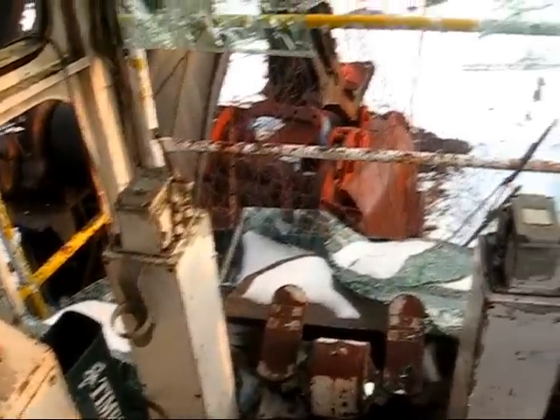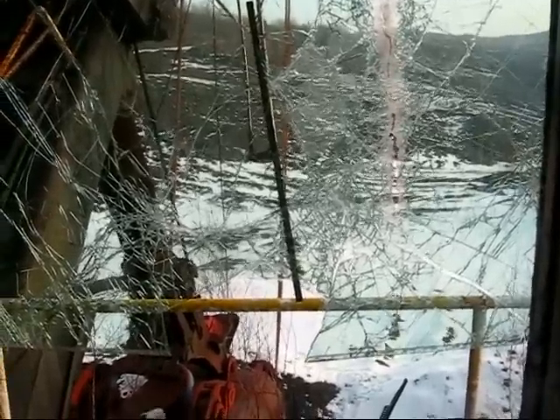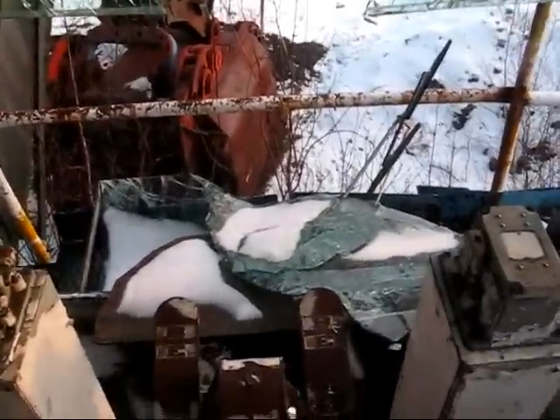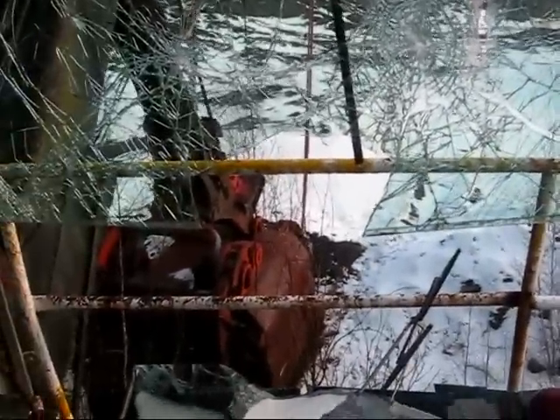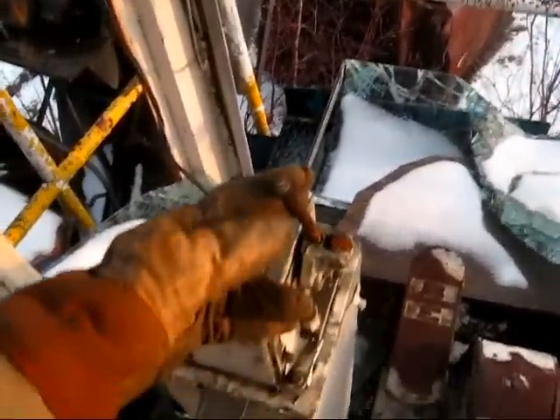Here's what's left of the operator's cab on the 195B. As you can see, this machine has been vandalized — the windows have been smashed, the seat's been torn off — but I'll show you what some of the hand levers and controls do. The cab is large and oversized and provides good visibility for the operator. On the floor you'll see two foot pedals for the swing, and the two hand levers on the right and left side control the digging functions on the machine.